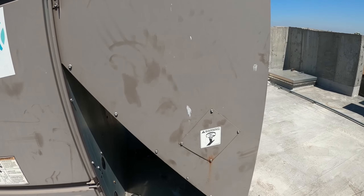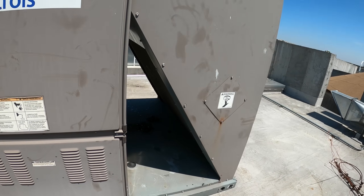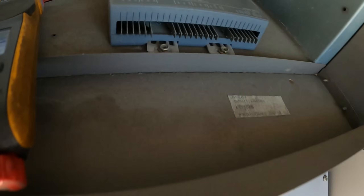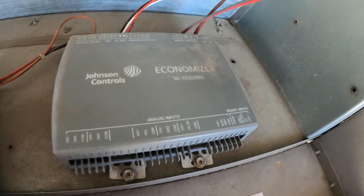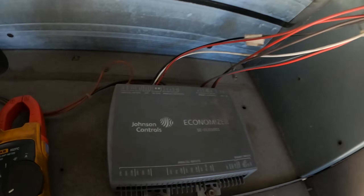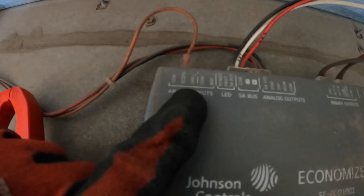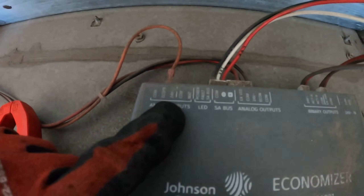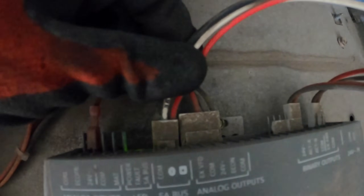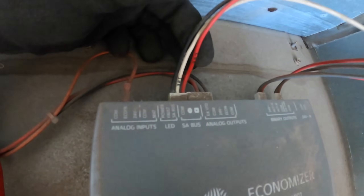Definitely we need to change the filter dryer because we have an open circuit sitting in moisture. We've got to change that condenser coil. Also over here is our economizer control — whenever you're checking sensors and stuff you want to confirm there's 24 volts. We have common and 24 volts between terminals three and four. This thing looked kind of loose — it looks like it was being pulled. I wonder if it's bad.